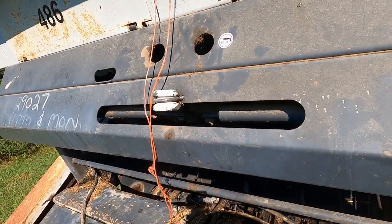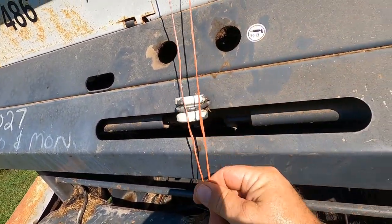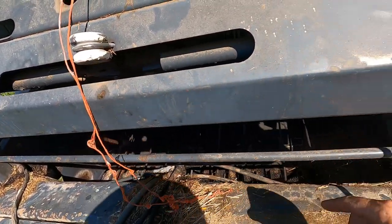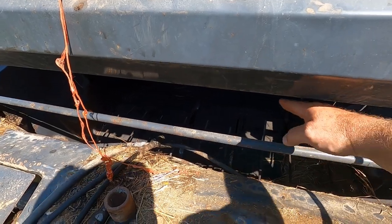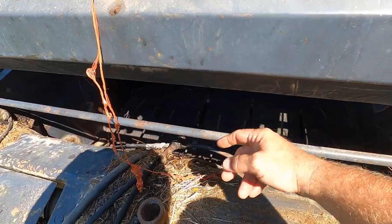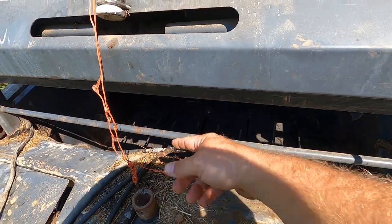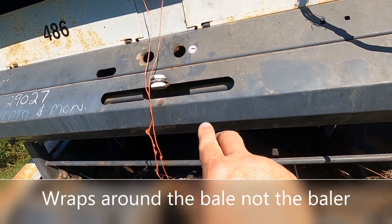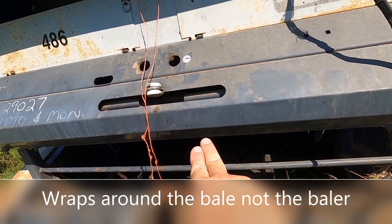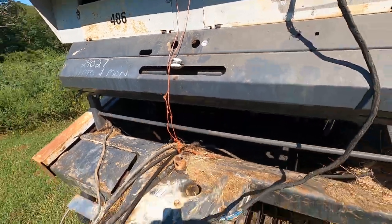This baler has an electric tie, which is what these arms are for. String comes out, goes through these tubes, comes down. When you hit an electric button on the monitor it allows these arms to come down. The twine goes down to the hay. I usually pull up, grab some hay to catch the strings, and it starts wrapping around the baler. It starts from the center and goes out. I come back in and go out again, then bring it back up, it cuts it, and I kick it out.